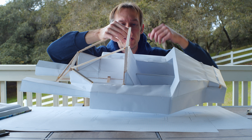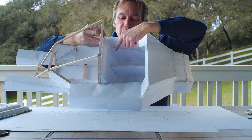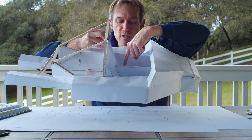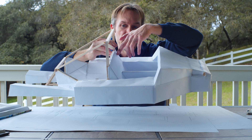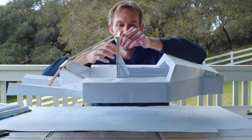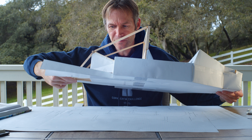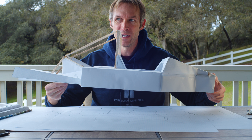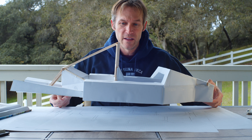Part of the reason I picked where I did for those tunnels is because I use the seat back as part of the chassis — it's structural. The tunnel throat starts right where the seat back meets the floor, so that part of the floor is really well supported with a straight load path to the rear bulkhead. Comparing this to my GT40 mock-up, this is way stiffer — it's hard to describe just how much stiffer this structure is, even though the middle is just paper.